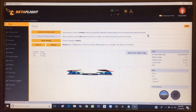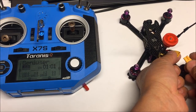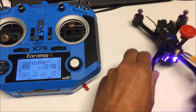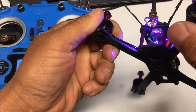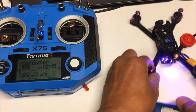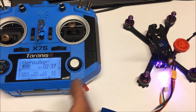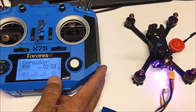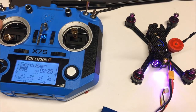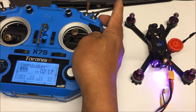The craft is ready to go. Plugging in the quadcopter for a final test with the Taranis already on. We should have connection. Arming the motors — motor stop is turned off so the motors arm in angle mode, horizon mode, or air mode. Buzzer, angle mode, horizon mode, and air mode are all working.